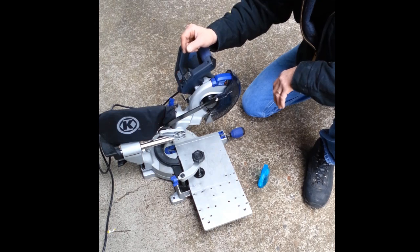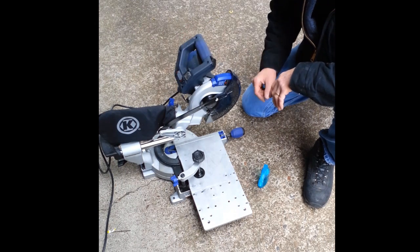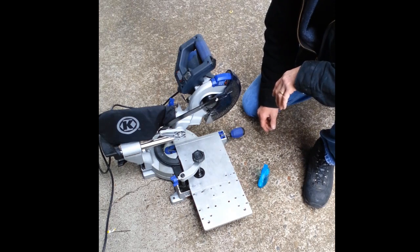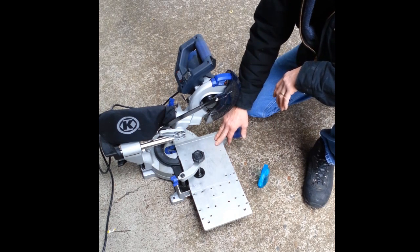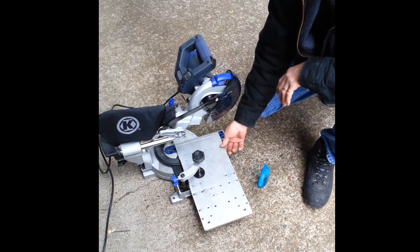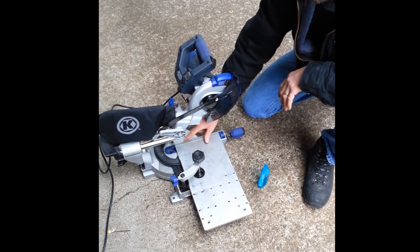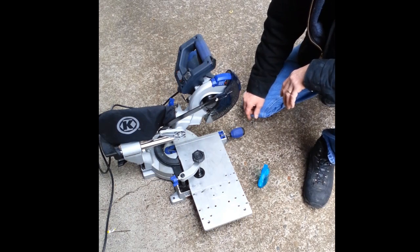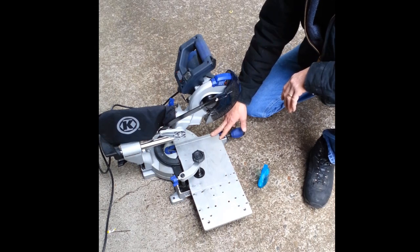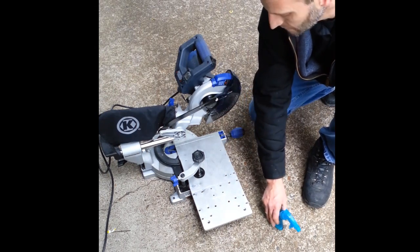Ideally on something like this you want to use a band saw, but you really can't get a good finish as far as butting up an edge. So this is the solution I came up with. I've cut quite a few pieces this way, and I decided before I'm almost done with my project to do one last cut — I need to shave a half an inch off this edge to make my Z-axis fit properly for what will hopefully be a somewhat large CNC router, or a mill when I'm done.